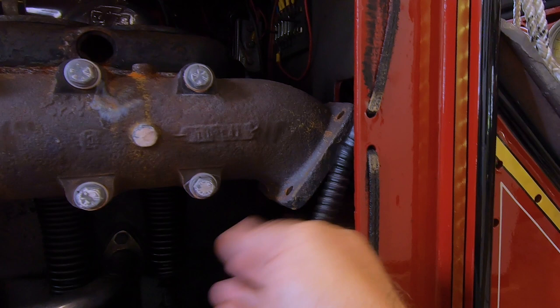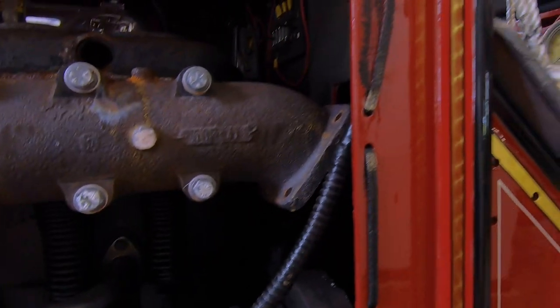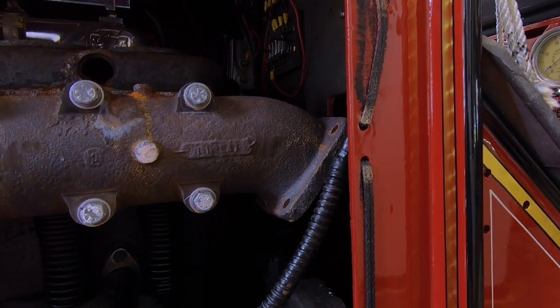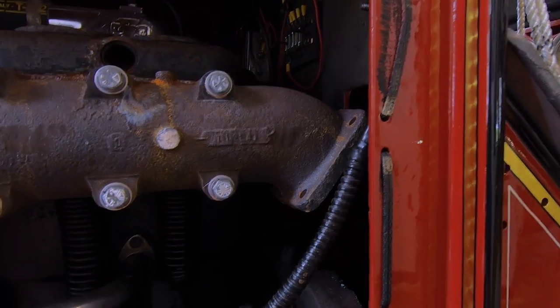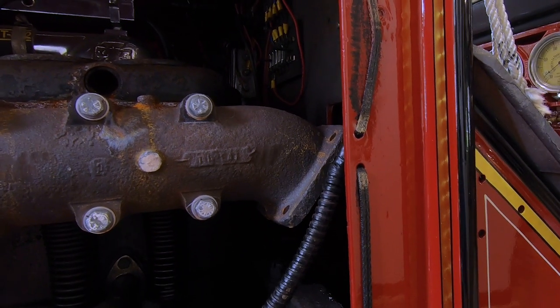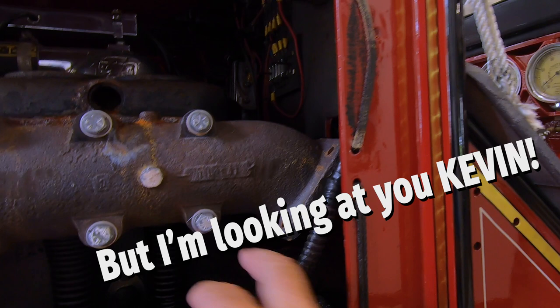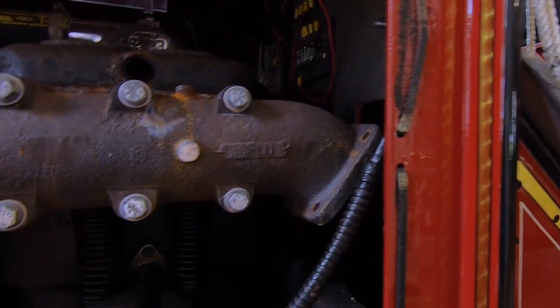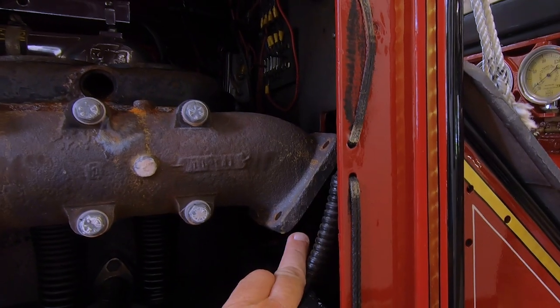What we have to do is make this gasket right here. When the truck was restored, I had to take the exhaust off, but the gaskets — one of them was a copper clad gasket, which appears to be correct. And there was another one that was just a fiber type gasket. The gasket was just roached. So the project for today is going to be to make four of these gaskets.